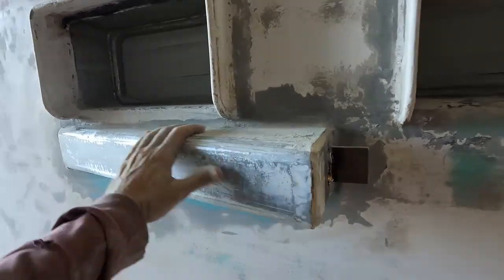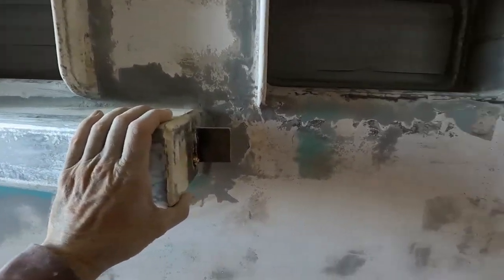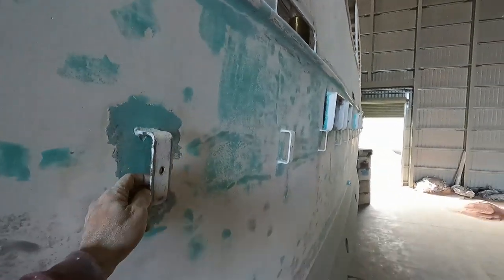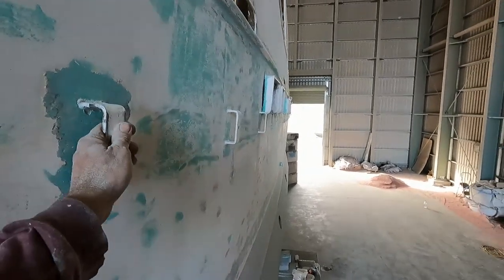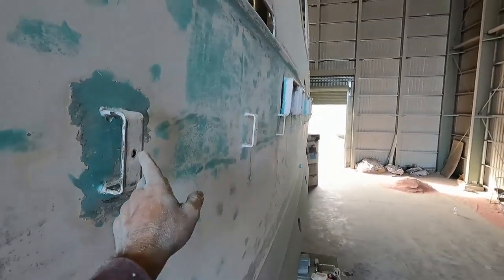There's four of these. Last time we came up, he put these on. So these are for our sponson. So we had timber along there, which we took off, which was had it. All these brackets are there, ready. We're going to make a new sponson, but we're going to make it much wider. So two different thicknesses of hardwood, probably epoxy glued together or something like that. And then they bolt through all these.